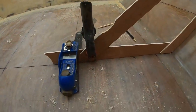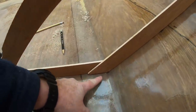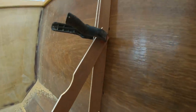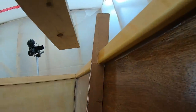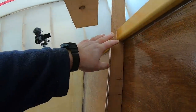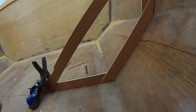Here's a close look at the template. This is the line it sits on — you can just make out the dotted plumb line that the bulkhead will be secured to. The fit is reasonably good — there's about a sixteenth-of-an-inch gap, and that's actually what we want so we can get glue inside. Overall, a nice tight fit.